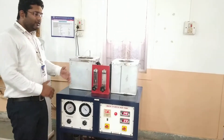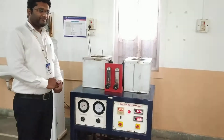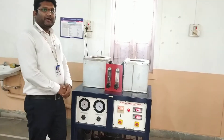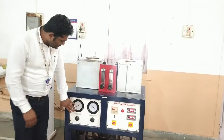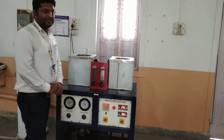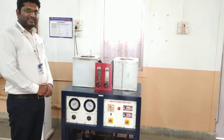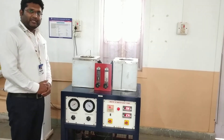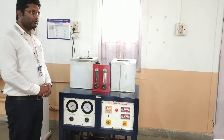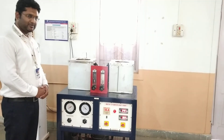We will do this by two different methods: the theoretical method using the P-H chart, as well as the actual method using measured temperature, suction pressure, discharge pressure, and actual power given to the compressor. Using these, we can find out the actual COP of refrigeration as well as the actual COP of the heat pump. With the help of PPTs, I will explain how to find the COP of refrigeration and COP of the heat pump using P-H charts. Thank you.